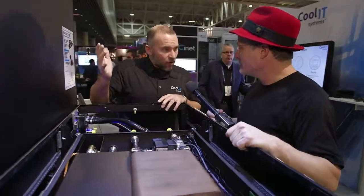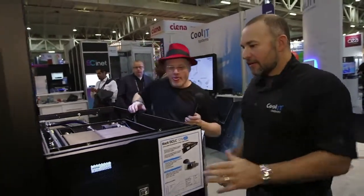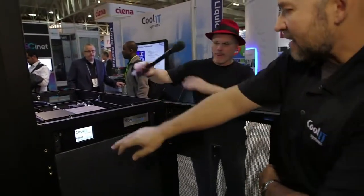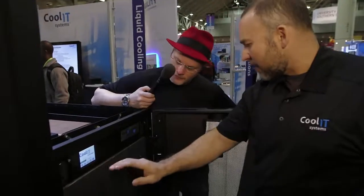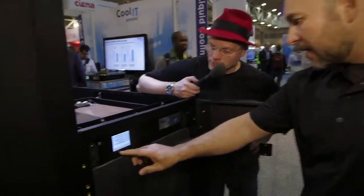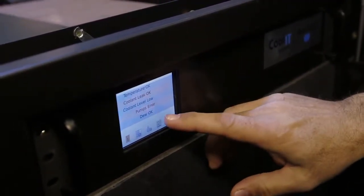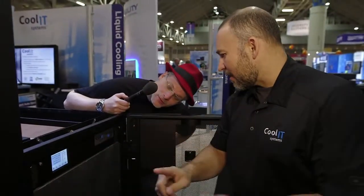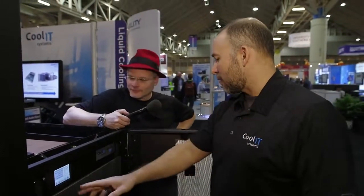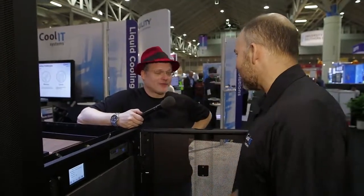The sensors and smart software detect if something is going on and throw an alert, shut the system down, and do the best to contain all coolant flow. We've got a touch screen on the front of each system monitoring that all temperatures are within alert limits. It's also monitoring high pressure, low pressure, flow, dew point, and humidity. It has an ability to log the system, and it's on the TCP/IP network so it can send out emails and be compatible with BMC, IPMI, or any other web server infrastructure the data center might have.